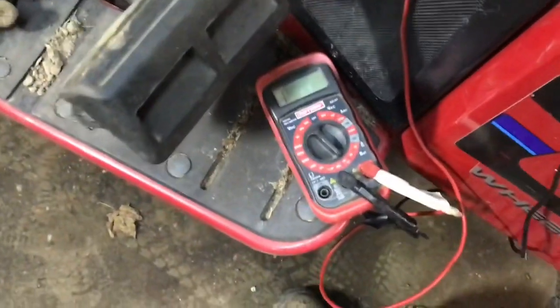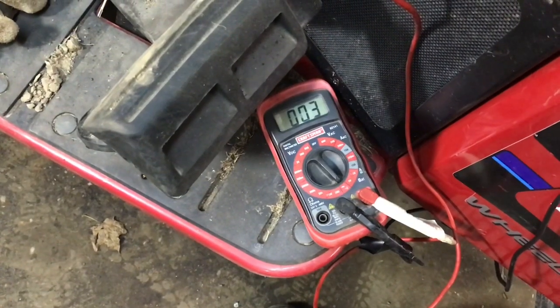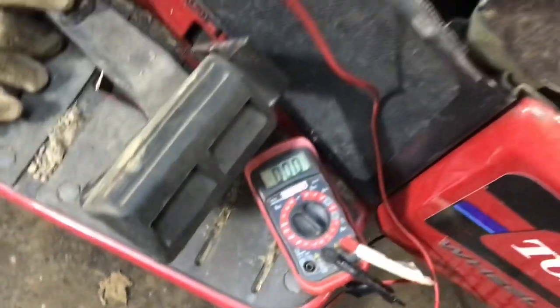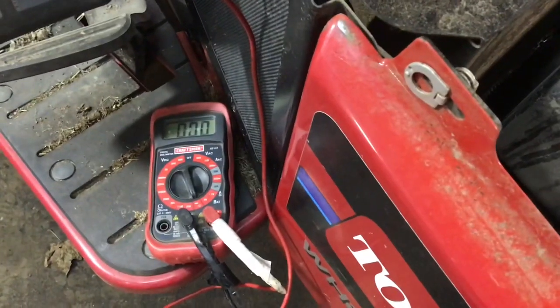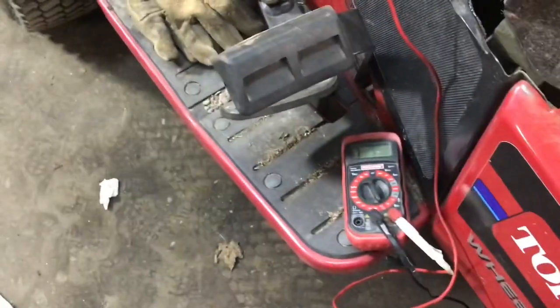I am on continuity mode, so I will receive a tone, but this is to ground and there's resistance — even just one ohm to ground could mean that's resistance through, say, that light bulb. Now if I hook up to this one, I get an instant zero ohms — there's no resistance, there's full continuity. So there's a difference between a resistance and a false continuity versus a sure actual continuity.